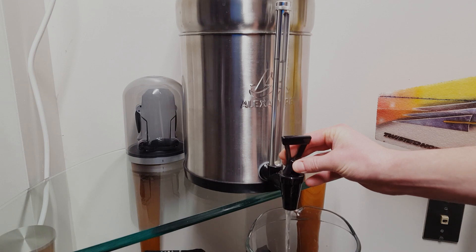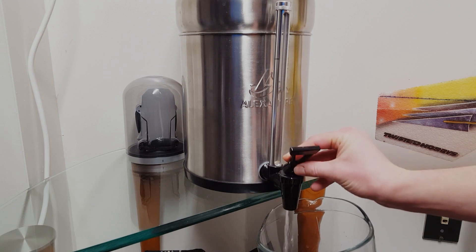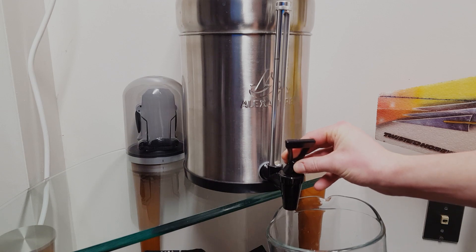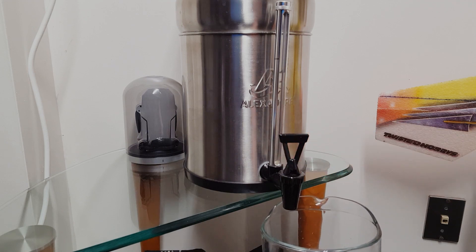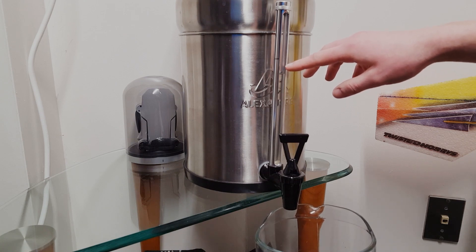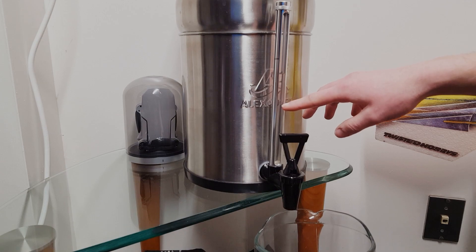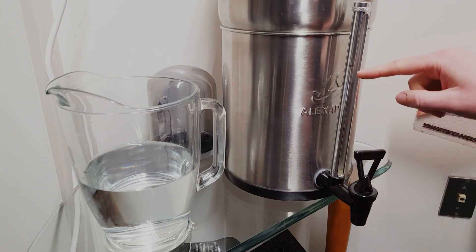You can see that the voltage dropped a little bit. And now let's say our refrigerator kicked on, which is a big inductive load — look at that sight glass drop. Now as this throttles back, you can see our voltage is rising back up. And now let's say everything shut off. You can see our voltage rises back up and this is the amount of capacity that we actually used, but you can see that the voltage dropped way down there.